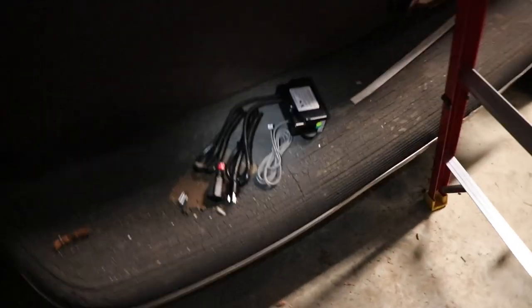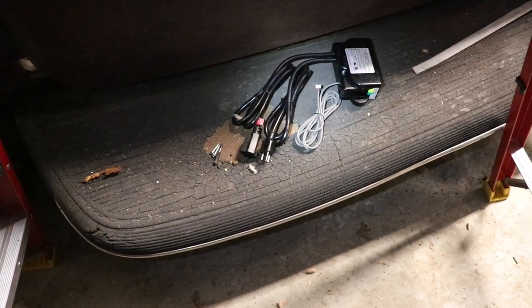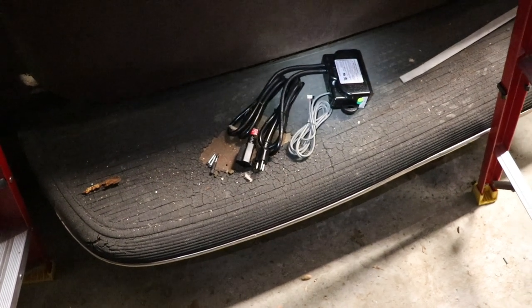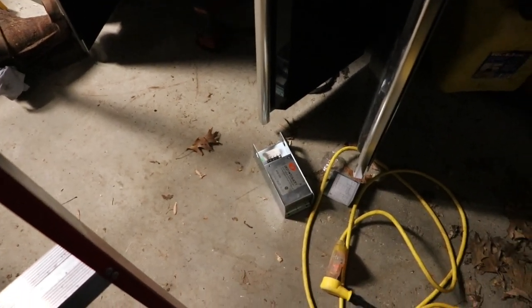So you are going to replace this box with that controller there. You're going to put a cord end on the motor and a receptacle on the house wiring so that you can make it like a conventional installation. I wouldn't bother trying to find one of these original controllers or fix it - there's a reason people are selling replacements for them. I wouldn't try to do anything creative either. You wouldn't want to electrocute yourself or somebody in your family.